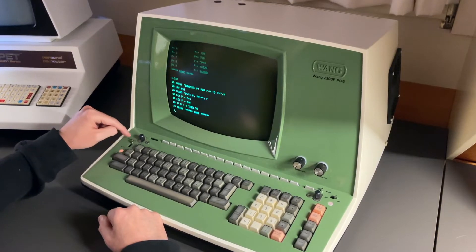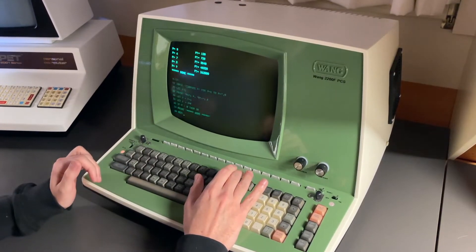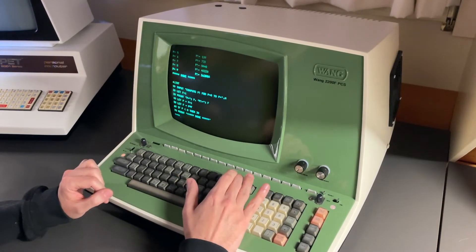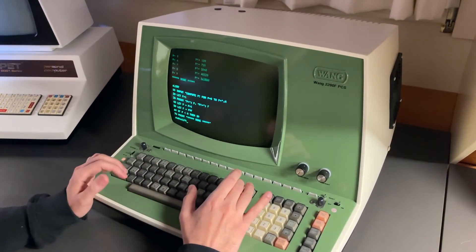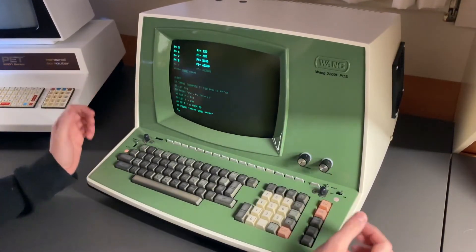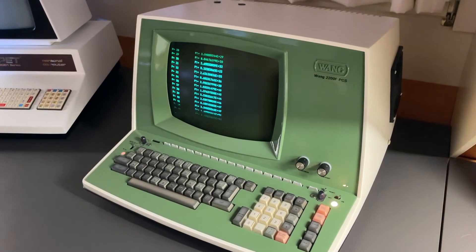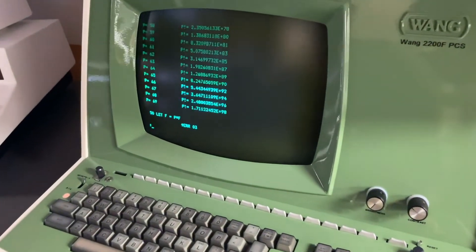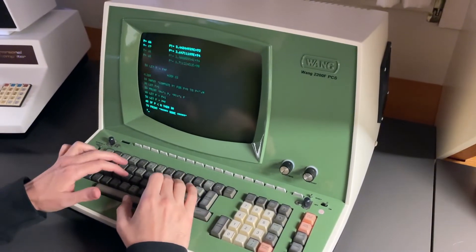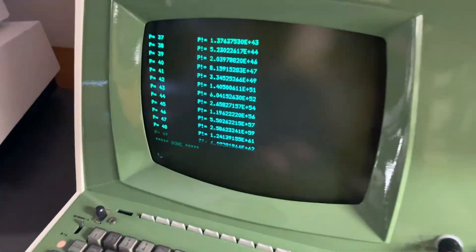If I put a large number it takes a long time, so I'll put 100. There is an interesting feature of this computer which makes it very easy to debug a BASIC program: I can halt execution at any time with the Halt and Step key, the program stops, and if I press it again it will step through the BASIC program and tell you which line it's executing. Next time we get to a print it will actually execute the print — there we go. You can just step through the entire program; it's very convenient. And if you're done with that you can just run the program to the end. It is very cool. This is it — I hope you've enjoyed it and I'll see you next time.